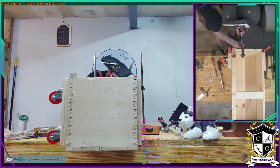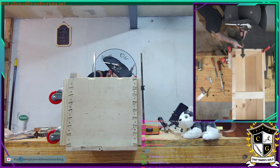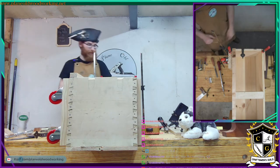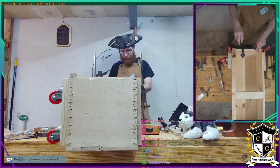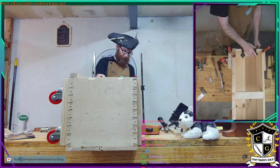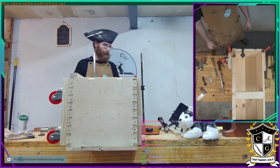Oh, well, remember what I said? Hardwood, definitely drive a steel screw first. This is white pine, and I can tell right now just the amount of resistance it has. We're fine. Just don't over tighten them because you will strip them right out. You'll shear the head. So we may not use the Yankee at all.